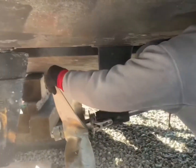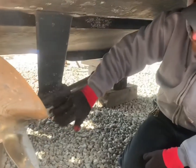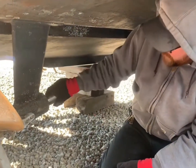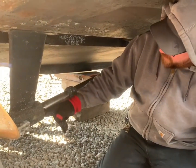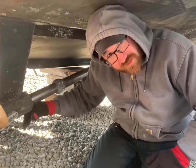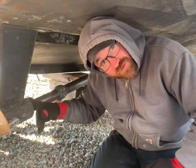So obviously you got your propeller — all boats have these. This boat has a line cutter; this stops a line from ripping out your strut, which is pretty important because when that happens it gets real expensive real quick. You've got your shaft — this is a 2-inch shaft. Inside your strut is your cutlass bearing, a very important part that should be serviced every 4 to 6 years. Follow us later to pull this propeller off.